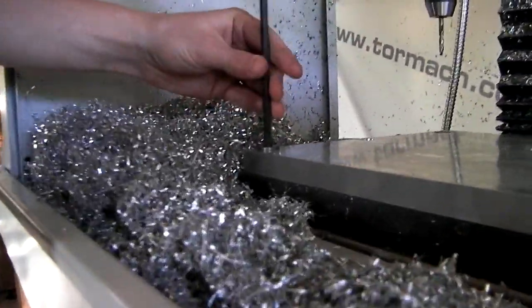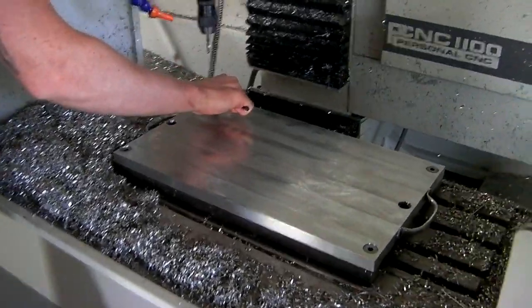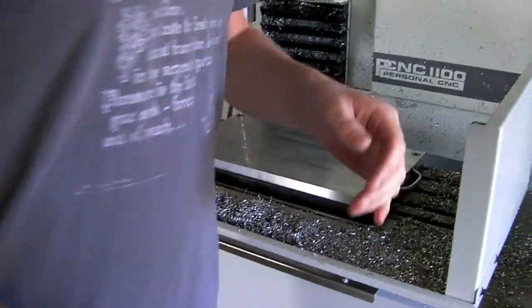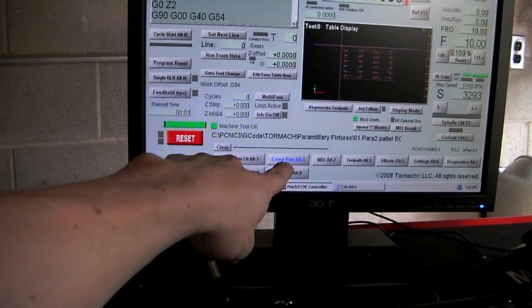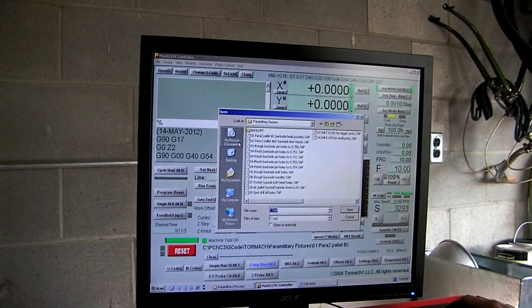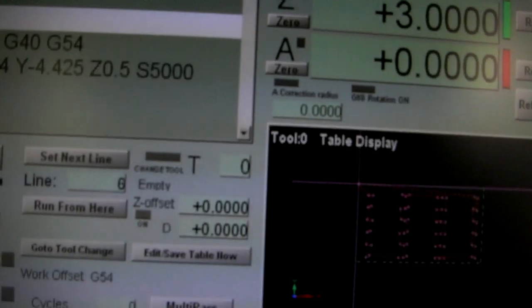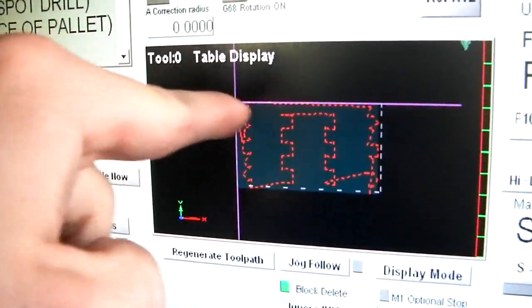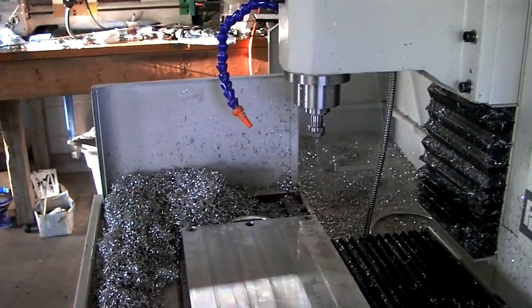Too many chips in the way — that's a lot of chips. This thing produces such a shower of chips, it's so cool. So we've already done the facing, we've already done the head holes. Eric's going to open a new file — notice how I've got them all numbered: spot drill. Here's the tool path — it's just a drilling code, locating to every hole, drill drill drill drill drill. The tool change was so fast you missed it, but we can do a dummy tool change — it's got a foot pedal.